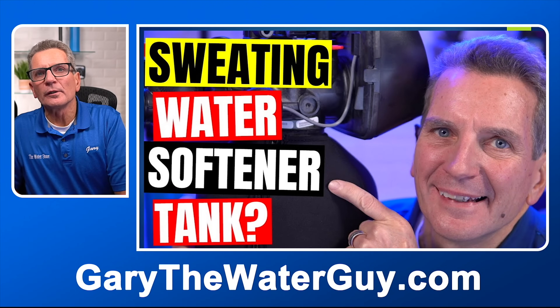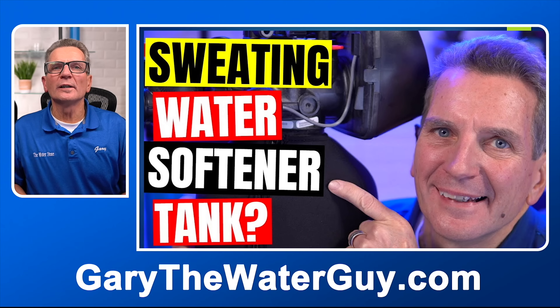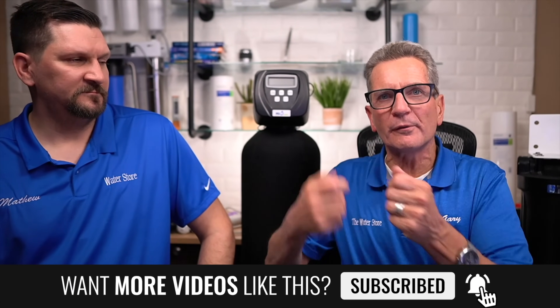You may notice that our water softeners have black neoprene jackets on them — like a scuba suit. The reason is that these tanks sweat and can get mold on them — that black stuff on the outside of your tank is mold. If you don't have a neoprene jacket on your water softener, we have them available. You just drape it around the tank and zip it up at the back — you don't have to disconnect any plumbing or remove the valve. It's also washable, so in five or ten years if it gets moldy, just take it off, wash it, and put it back on.